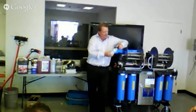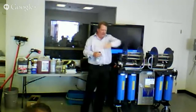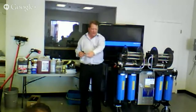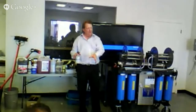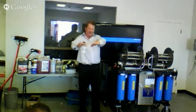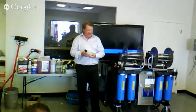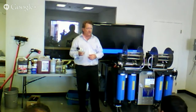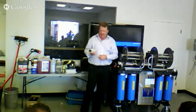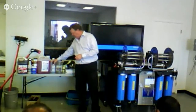Generally, when I'm doing it, I'm spraying this from a pump-up sprayer, and I just did a driveway-sized piece last week that had a bunch of mottled spots on it. And you work your way back and forth with the sprayer, and then I just slow down where the orange rust was, just perceptibly so, to put a little more product where the rust is, and then smooth up. And you get a nice, whitened, brightened concrete area without the rust on there. And it's magical. Customers very rarely have another opportunity to remove rust from their surface, so it's very little competition. And you can watch the videos on our website or on F9s.